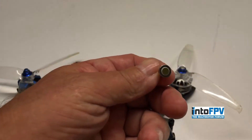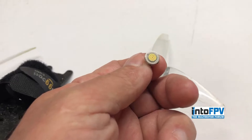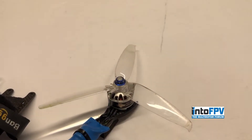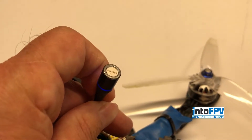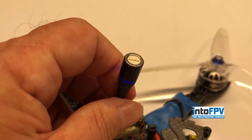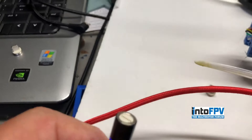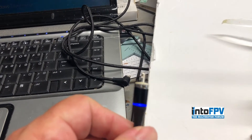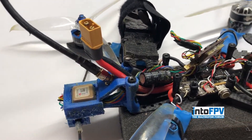There is one drawback you really need to be aware of — these things are magnets. If you're working on a bench where you have any small metallic shavings from drilling or anything like that, and you lay the cord down on the bench, this thing is going to pick up those metal filings. When it does, there's a good chance you're going to short out some of the connections. So what I do is put one of the extra tips on it when I put it away — that way there's no chance of shorting it out.